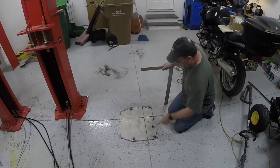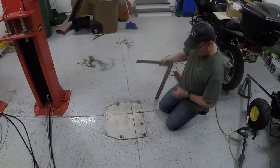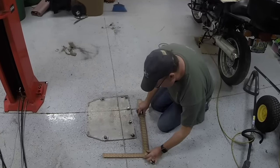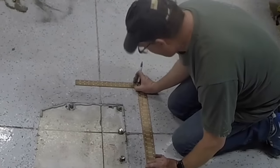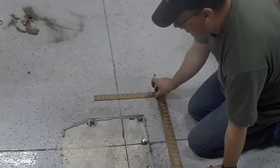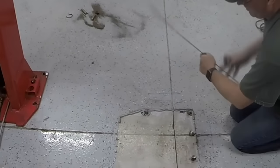Basically a 24 by 30 inch pad over this. This is gonna give you about 6 inches either side. So, can I make it nice and easy for this? We're gonna pour this 7 inches thick, because these bolts didn't get far enough in the concrete or the concrete wasn't deep enough. Not sure which, somehow I failed.